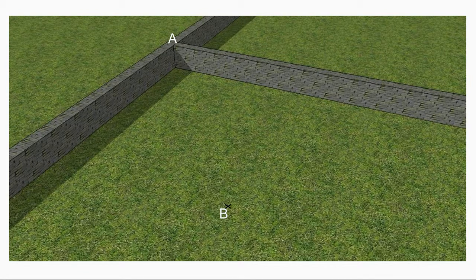To set up and orientate the total station on site, you'll need to get hold of the most detailed Ordnance Survey map that you can, and get the grid reference of a prominent feature such as a building or a field corner — in this example, point A.